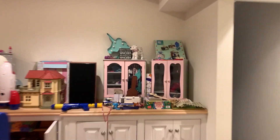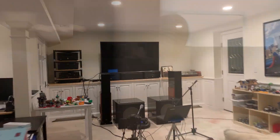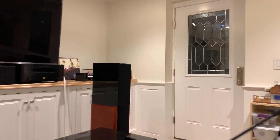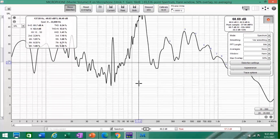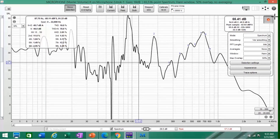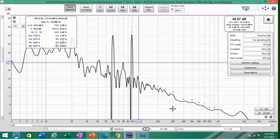Now this air conditioner is back here. The noise that we were hearing at 120 Hertz has gone away. You can see that the noise at 120 Hertz has gone away with the air conditioning being shut off. So that is one of the items that we have to resolve.